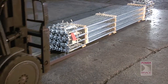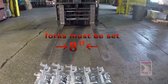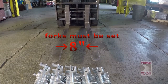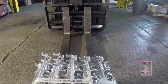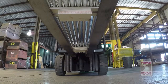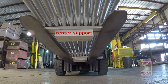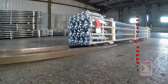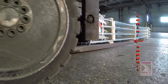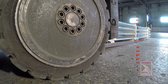The tip of a five-foot fork should reach the center of the wooden support. For the forks to lift the lock rod bundle properly, they must be set eight inches apart — the inside dimension between the two forks. When we band each lock rod bundle, the center wooden support helps stabilize the lock rods and make the lock rod bundle easier to move and transport. The end of a five-foot fork will fit perfectly under the center wooden support and will be snug against either side of the shorter block.